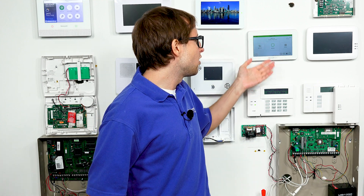There should not be a low battery on the VISTA system. On ours, we don't have any low battery message — we have a good battery and we're plugged into AC transformer power, so we would be ready to receive the firmware update. The firmware update will not be sent down if the system is currently in programming mode, whether that's console mode on the Tuxedo or installer programming — if you leave the system in that mode, a firmware update cannot be sent down. You also can't receive a firmware update if there is an ECP error, which is basically a communication error. Make sure the wires are connected between the Tuxedo and the VISTA panel, and fix any ECP error if there is one.